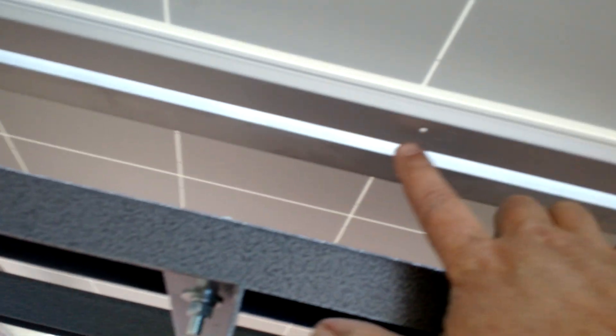That's how the mount goes to the post. You have these upright brackets that hold the panels. Here's all your electrical connections from the panels. This is for grounding the panels — all this has to be bonded right back to the disconnect box, which is where the ground rod is. So all this will be bonded back to there.